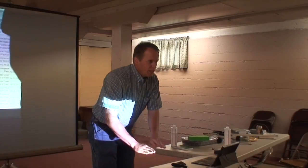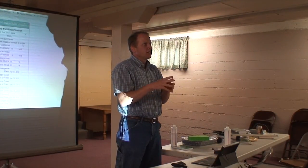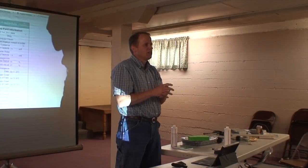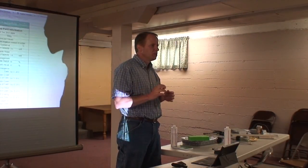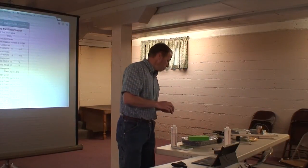They take these two electrical contacts and put them right next to the soil, and the capacitance depends on how much water is in the soil. They have electronics that will measure the capacitance of the soil, and then you turn that into a soil water content. A good thing about them is that they're electronically readable. You can have them hooked up to a telemetry system, so in the morning in your underwear, you can check what your soil water content is on your computer or whatever.